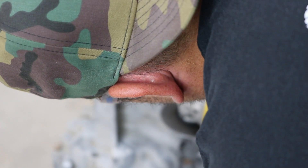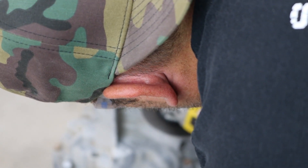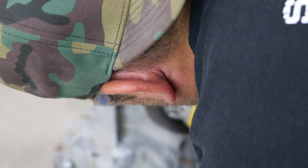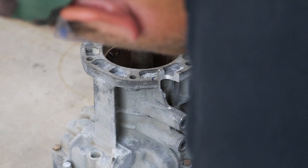I cannot find an angle to do this where I was not in the way. I am cutting that support rib straight across to the edge where the hole saw went all the way down. This is going to give me enough room to get a hacksaw in so I can trim the rest of it out. I could probably do this with a sawzall but it is aluminum and it cuts so fast that a hacksaw is just fine.